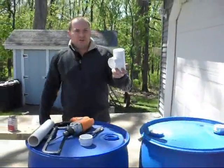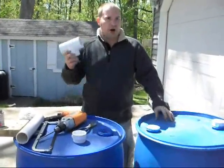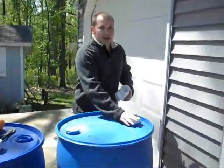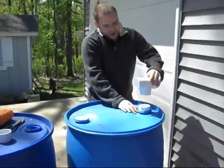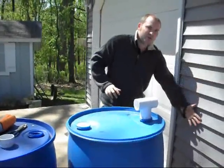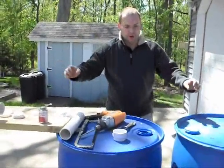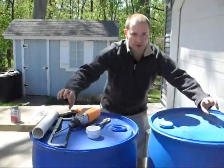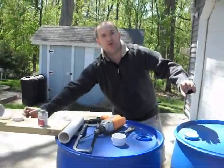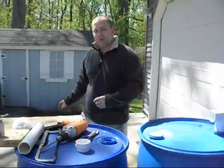Next is a two-inch PVC T-connector. Since I already have a rain barrel system and I'm adding on to it, all I need are these T-connectors. I've already got this male threaded in the pipe here, in the hole, and this will sit on top just like this. Now, the very first barrel and the very last barrel will have a 90-degree elbow, because the PVC pipe goes through here to connect all your barrels, and then at the very end it needs to elbow into that barrel, and on the other side you will also go into that barrel as well.